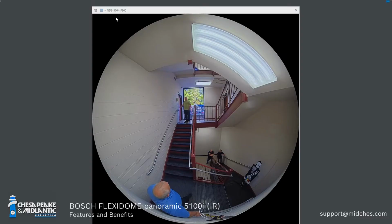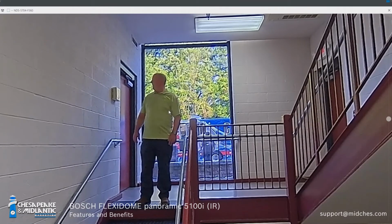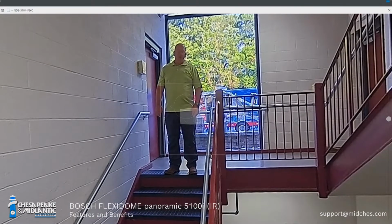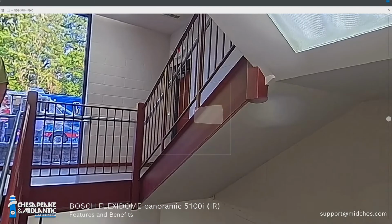One other cool thing about the camera is 120 dB HDR capability on these models. So that's really nice for use cases such as stairwells in one of the videos that we will be releasing, dark areas or bright lights. It makes the scene much more even, easier to be able to tell detailed faces, who the person is, especially outside, in bright lights or very dark darks. It makes a scene much easier to tell what that object is. Lobbies, stairwells, anything like that where there's lots of windows that create terrible lighting situations for traditional cameras.